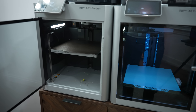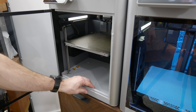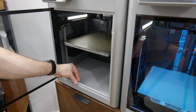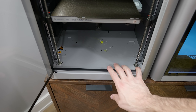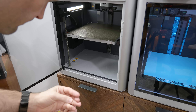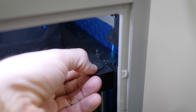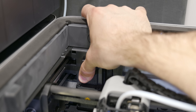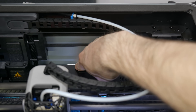Another very common problem that anyone with an enclosed 3D printer can relate to is that a lot of debris ends up falling off the bed and getting trapped inside the bottom of the printer. And to make matters worse, most have a little lip that prevents you from just sweeping it all out. So another very simple mod is this little wedge that you print and place at the front of your case — it makes it so much easier to keep your printer clean. In a similar vein, I printed out a whole bunch of little dust covers for the various openings and crevices inside the printer. These take next to no time to print and offer nice peace of mind.